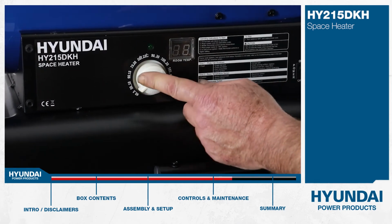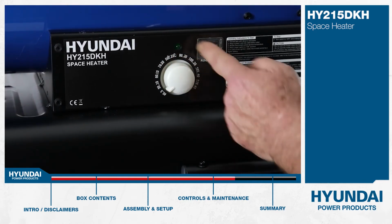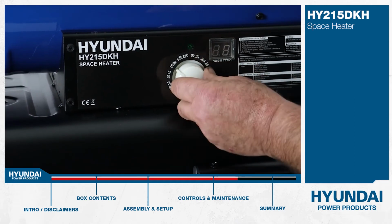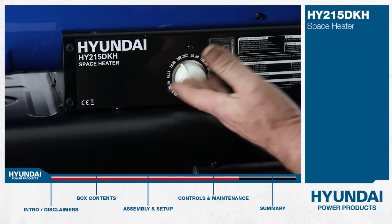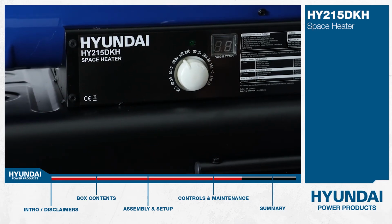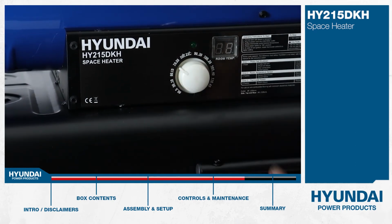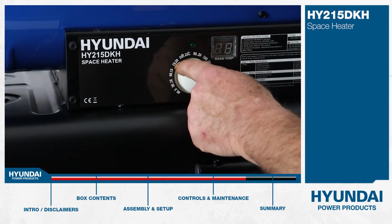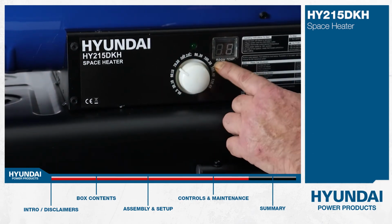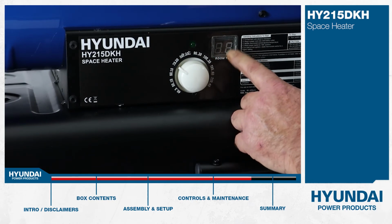Next control we're going to look at is this thermostat knob here. Now the temperatures are graduated in centigrade and Fahrenheit. So for instance, if I was to turn the knob to here, it would keep outputting until the room temperature reached 80 degrees or 25 centigrade. Again, if I turned it down, the machine would cut out when the room temperature reaches 20 centigrade or 70 Fahrenheit. And the actual room temperature will be shown on this digital display here.